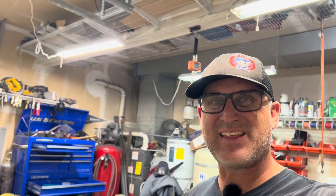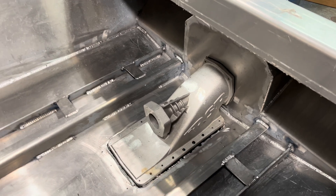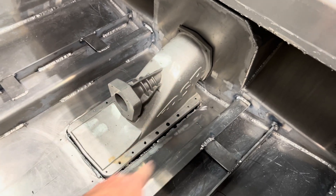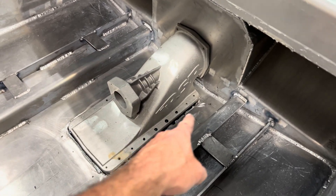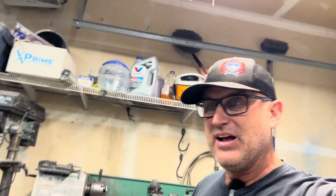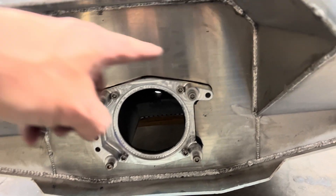I'm not covered in 5200 - I'd say that was a success. There are probably 15 to 20 quarter-20 bolts holding that thing in, plus four bolts going through the transom. It's sealed completely around on the outside, taped off around the transom. Down in the bilge I don't care about appearances - you're never going to see that anyway. On the transom back here, that thing is bolted and glued, sealed all the way around. I put a bead all the way around the outside and a bead around the inside so that any bolt holes have adhesive sealant completely around them.